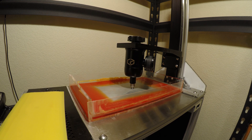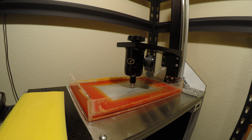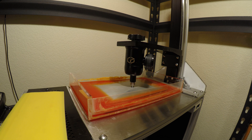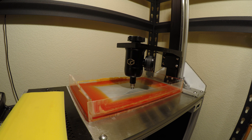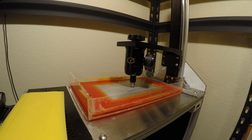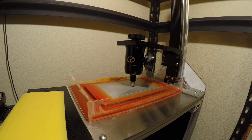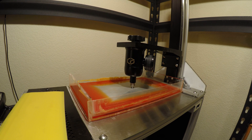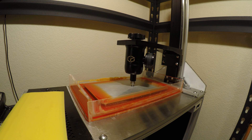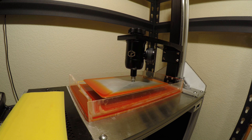The base areas that were fully solid needed about 10 millimeters of lift, and now I'm on only lettering — about five millimeters of lift is sufficient. I am lifting slowly: at 15 millimeters per minute for the solid layers and then 25 millimeters per minute for the lettering areas.